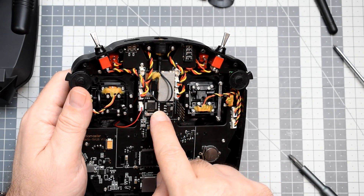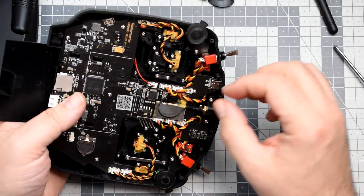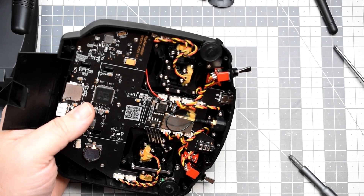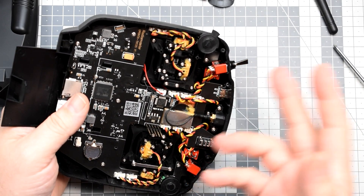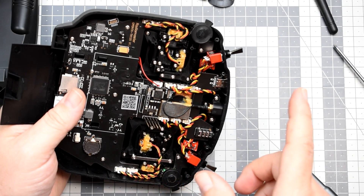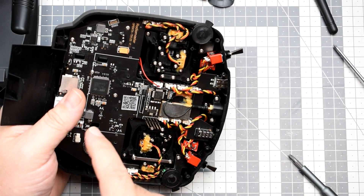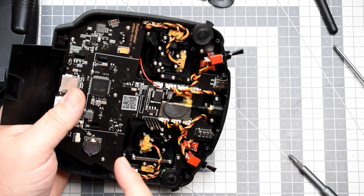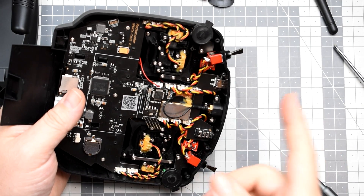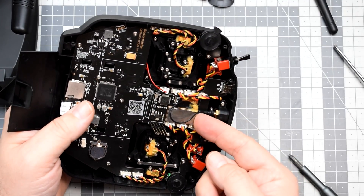The multi-protocol module here, compared to the full multi-protocol module, has only one radio chipset — the CC2500 — which is the same chipset that FrSky uses. This radio is made compatible with FrSky. I think FlySky also uses the CC2500, but you cannot select the FlySky protocol on this radio, which I really wonder about. If you have any receiver from FrSky — probably not ACCESS — this radio can talk to it.